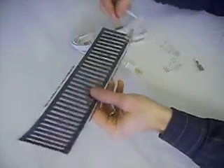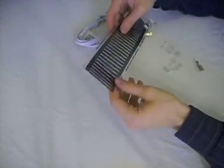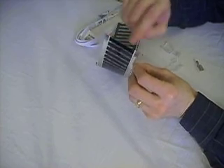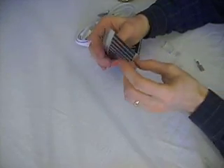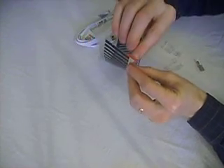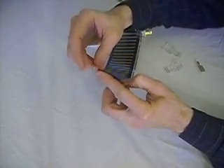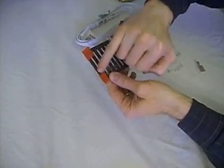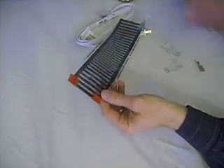One more thing — this other end, however long your heat tape is (it can be up to about 24 feet, which is what the manufacturer recommends you don't exceed), those two little ends right there are exposed wires and you don't want those to remain exposed. Take a little electrical tape — I like red because it's easy to see and it's obvious that it's insulated. Put it over both sides, take a second piece on the other side, and make sure those are covered. If any of the black strip is right next to the edge and exposed, you'll want to cover that entire exposed surface.